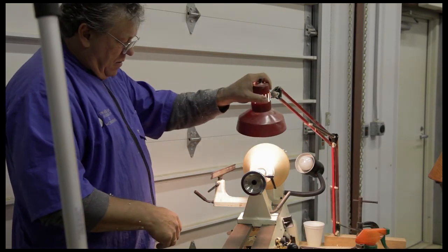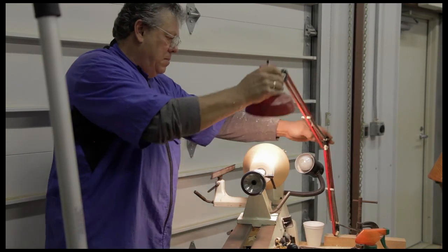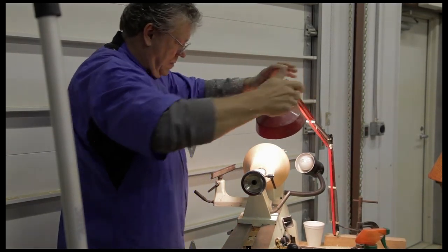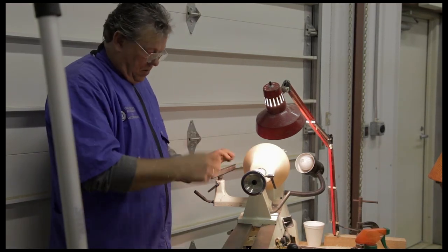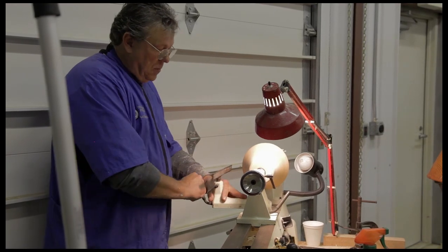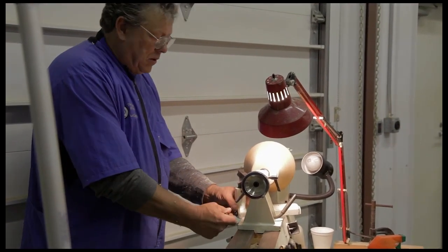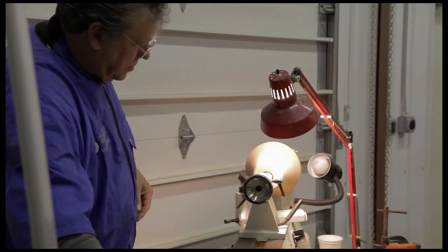And I'll come around now and remove this wood. And it looked like the very middle bottom is right about at that shoulder where the chuck jaws bottomed out. So that's as deep as it's hollow. That's where we're aiming for, a little higher than that. About halfway between the shoulder and the blue line is going to be the top of this thing.